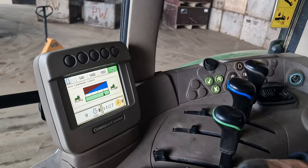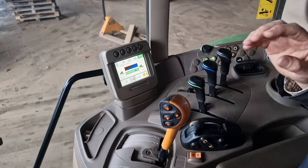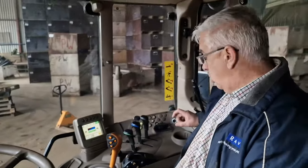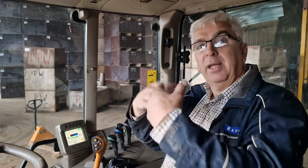You shouldn't actually need to adjust that most of the day. On a lot of the more modern tractors, especially the New Holland, there's two lights - one for up, one for down. When you're working the implement, if you've got that set correctly, those buttons should flash equally up and down. That way you know it's letting the implement into the ground and then lifting a little bit - letting it in, lifting a bit. They shouldn't be dashing about, but should be gently on-off, on-off with each one, and that's how you know it's adjusting.